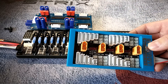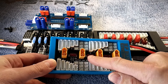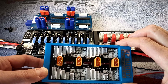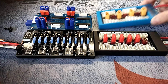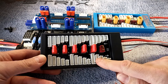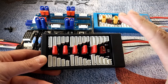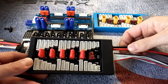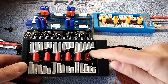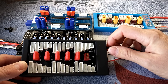Pretty much what I've used up to this date is this board here, and as you can see it's got resettable poly fuses down here and individual fuses in between here as well. I'll tell you why I'm pretty passionate about this: my original boards were like this, and as you can see there's no fuses anywhere — not on the main leads or the balance leads. Basically what happened was I was charging two batteries at about 8 amps and these wires inside this board that were soldered onto the printed circuit board came loose during a charging cycle and touched each other, causing a short.